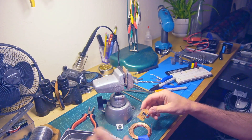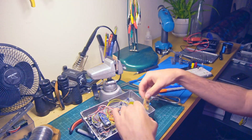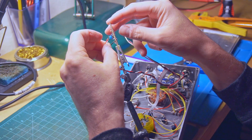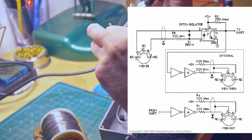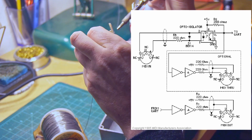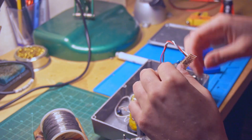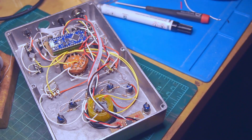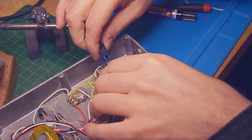After that, I cut it down to size and then solder on some wires to make connections to the external MIDI jacks. The optocoupler arrangement is from the actual MIDI specification published in the 80s, and the purpose of it is to electrically separate all of the grounds of your different audio devices so that you don't get ground loops built up across these MIDI cables. Next, I need to add a couple of connections to the main Arduino board for serial input, power, and ground, and of course connect the shift button.